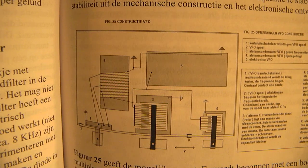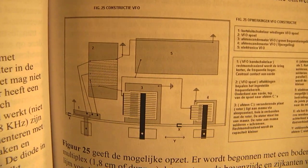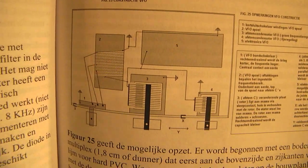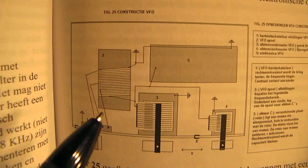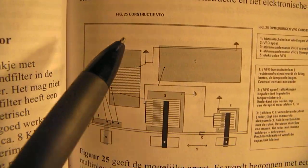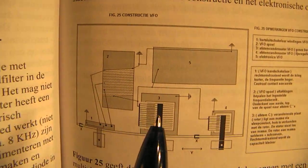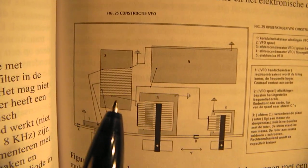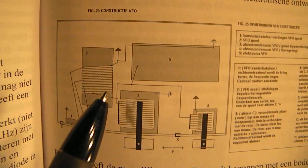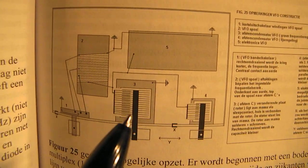When you mount it completely in a tin plate box, you will see that the frequency of your oscillator goes up because of the effect of the tin plate. So the coil must not be mounted too close to the tin plate box — there must be some clearance around it. When the tuning coil is close to the tin plate you get a somewhat different frequency band, but you can always correct that with parallel capacitors to support the capacitance of the tuning capacitor.